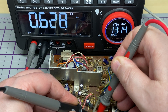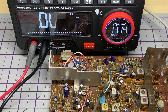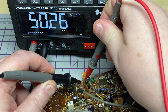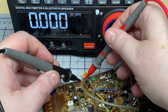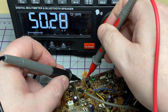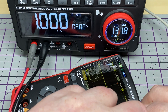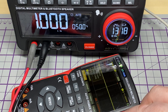Let's read some components on a board. I found a diode here in diode test — 0.6 volt drop, no problem. Let's see if it'll read this disc capacitor in circuit. Yeah, it should be 47 picofarads — 50 is good enough for a ceramic, no problem there. Reading things in circuit can always be a little bit inaccurate due to other components around it. Now the frequency counter — I've got a 1kHz signal outputting from the oscilloscope and it's reading 1kHz bang on. Very nice.